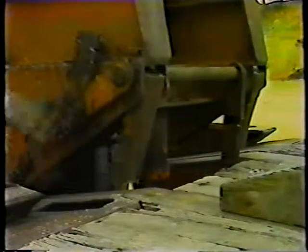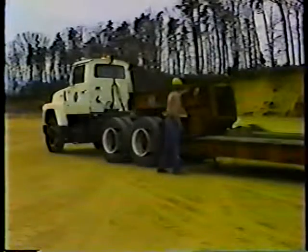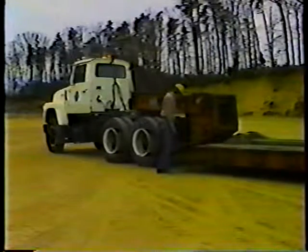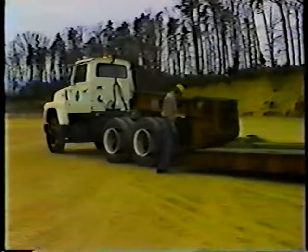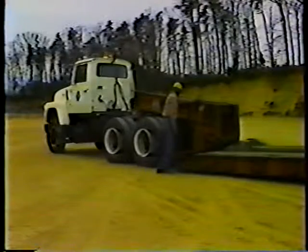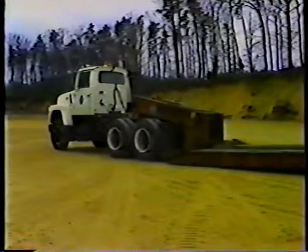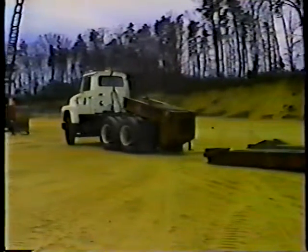Next, lift the lever that controls the two stabilizer bars. These bars keep the gooseneck and trailer level and prevent the two parts from bending during towing. Then lift the hydraulic control valve. This lifts the hydraulic ram and allows the trailer bed to lower. Lower the bed completely to the ground. Then climb into the truck. Release the emergency brake and drive forward enough to give the equipment operator plenty of room to load the equipment.